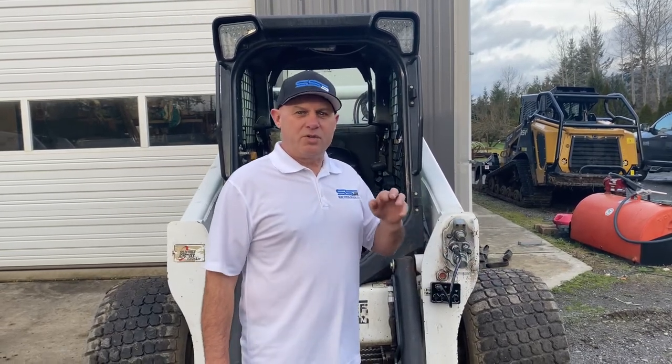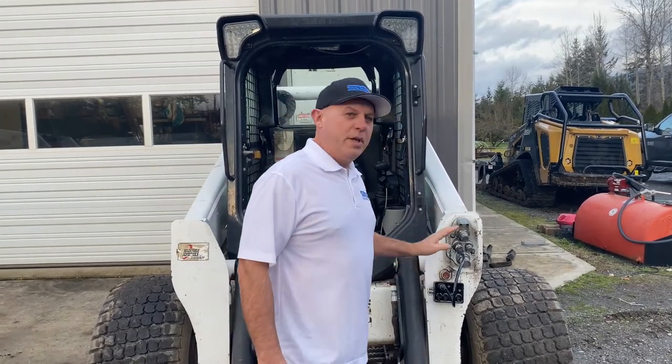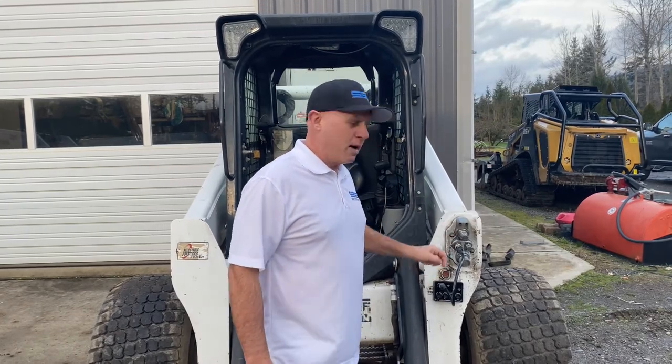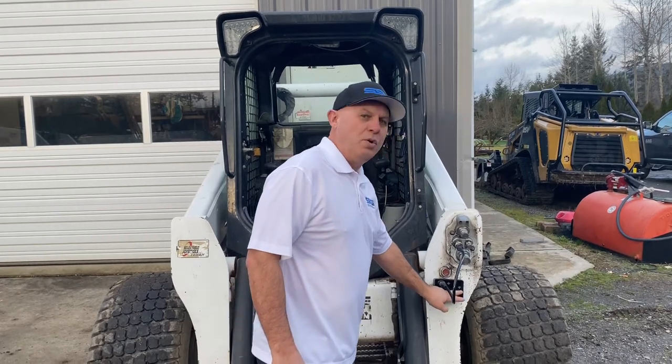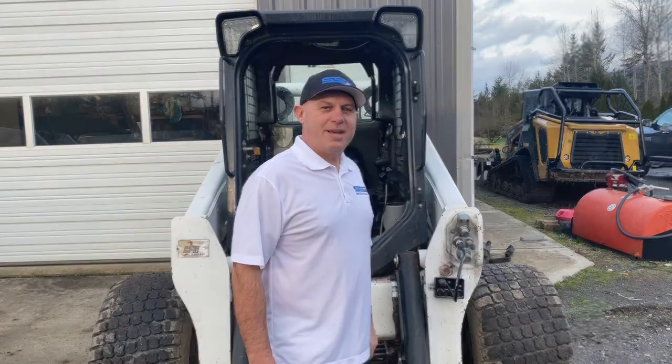And the only way you can control that is you want to go plus 12 in one direction, negative 12 in the other direction. And the only way you can do that is we've done this software in such a way that you can reprogram this box. So it'll go from four positive 12 outputs to two plus and negative 12 volt outputs. And I'm just going to show you exactly how to do that.